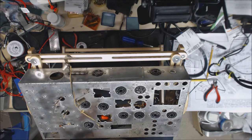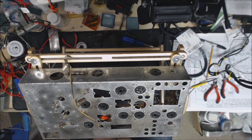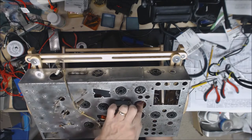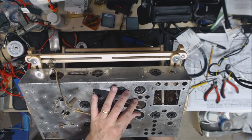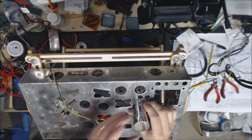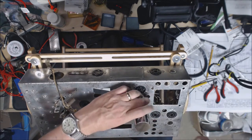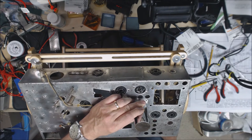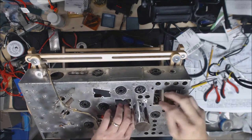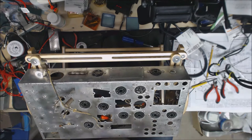And we'll go ahead and turn on the soldering iron here, see if I can't get a little dab of solder on each one of those, make good electrical contact. And then this actually will mount from the underside of the chassis, or at least the old one did, through the hole. Well, no it won't, because it doesn't fit on this one, so we have to mount it from the top. I'll decide whether I'm going to use hardware, or if I use stainless steel rivets on that. I'm not sure I'm going to be able to get my rivet gun on there real good, so I'll probably just use a little mounting screw and nut to mount that. So I'm going to pause it here, get those soldered on and get it mounted. Then we'll flip it over and start attaching wires to it.